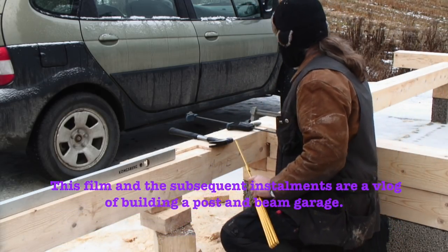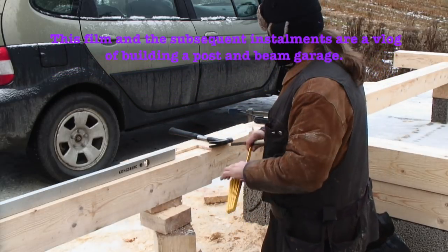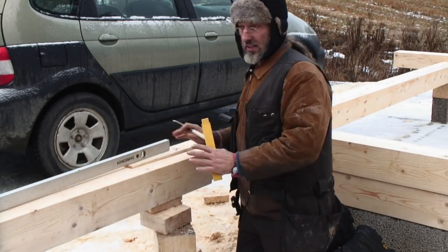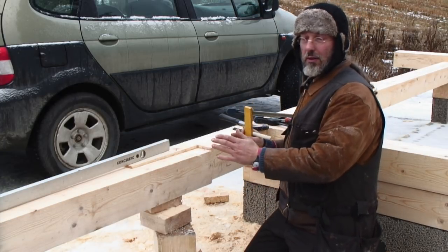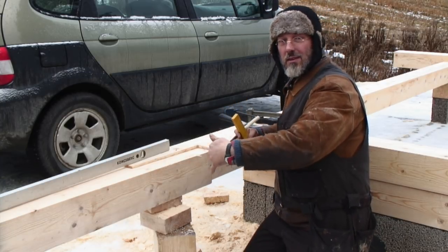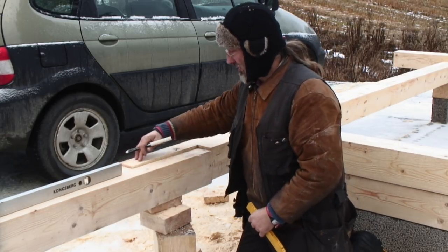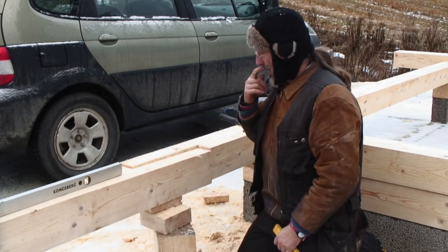Okay, on Friday last week, I did this purlin beam here, and I decided, because the structural purpose of this is to stop the house from falling apart sideways, and that's where the tension is going to be pulling outwards, I've gone for this long vertical connection joint.